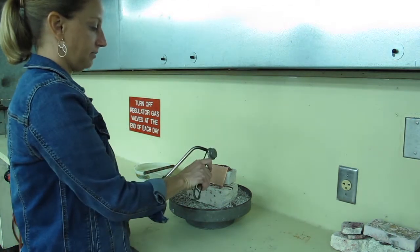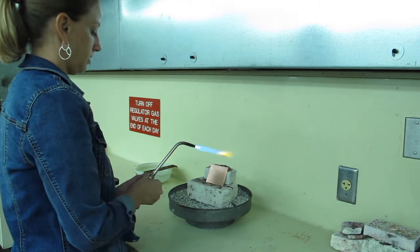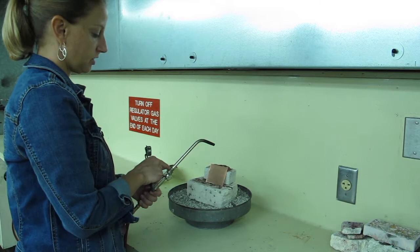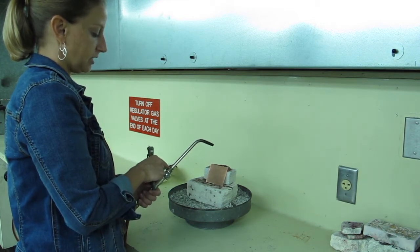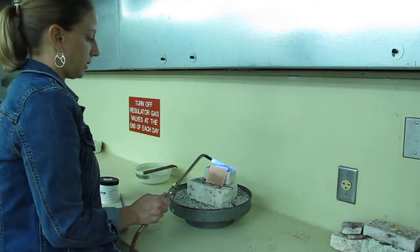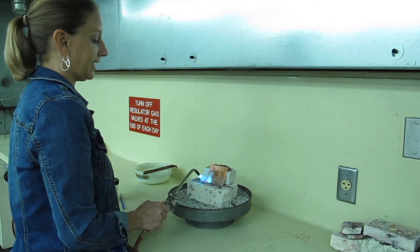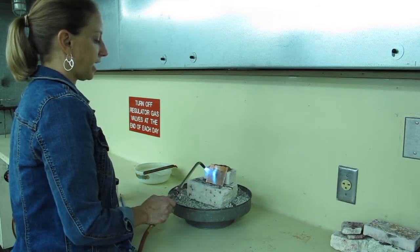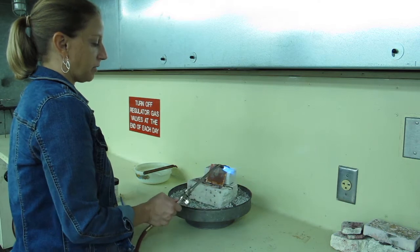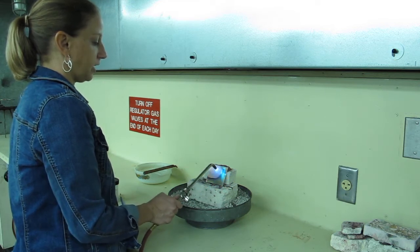I'm going to strike from the top of the side — when you strike, you need to be pushing down and pulling across to get that spark. Striking from the top of the side is important so that you don't burn yourself with the reflection. I'm going to go just nice and easy, keeping the heat on the metal, just like I would be spray painting something. I can pull my heat off the metal and you can see there's a color change — this is what we call the rainbow stage. The metal is getting nice and hot and there's that really good rainbow stage.